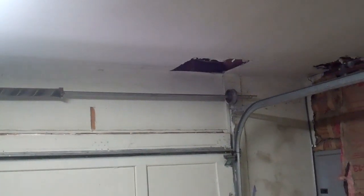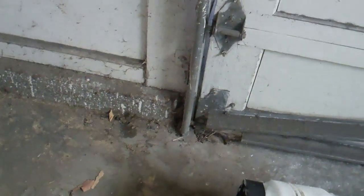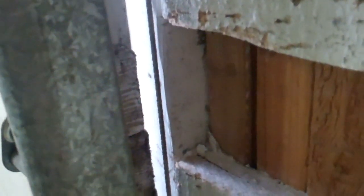This is going to have to go about two inches up in the ceiling, so the first thing I'm going to do before I take that door down is cut the hole in the sheetrock and rework it to where it goes up in there. I'm also going to have to grind the foundation out on both sides a little bit, and all this trim that's on here is going to have to come off and be cut where it's flat, right up against the two by fours the way it's supposed to be.